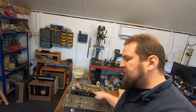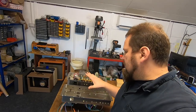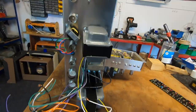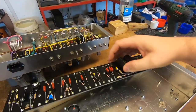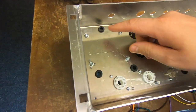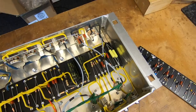As you remember, I've just finished off that Ainsley Lister chassis — that one's going to North America. And I just need to move on and continue with this one. We've got all of the transformers and sockets and things mounted, the board is populated, and I've got all my mounts in place, so I've got to do all my flying leads and twisties on the board, and I've also got to start my chassis wiring in here.